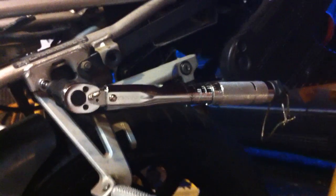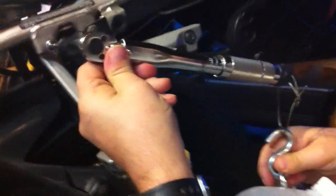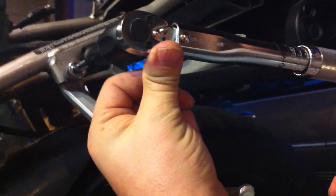What I'm going to do now, hopefully I won't drop it, is put the camera up, and now I'm just going to take my 2 gallons of water and hang them. I have an S-clamp set up, and I'm hanging it, letting go of the water slowly, and when I reach the full amount of weight, it should click, which it just did. I've attached this to the frame of the bike, so I'm torquing something that's already torqued. So 166, just right when I'm letting go.